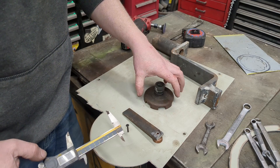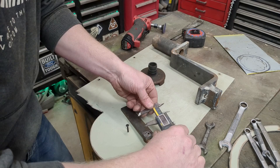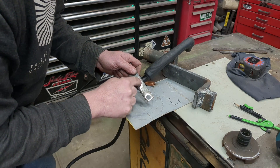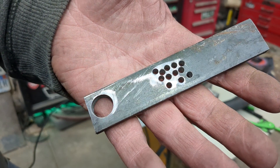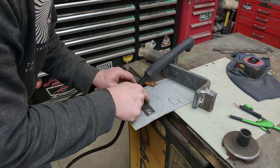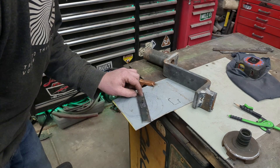I actually need to make a donut for this — a piece of sheet metal that sits up about half an inch around this. All I do is take my diameter here so we have our tip through here, halve it, and then mark where one hole is and drill a hole there, then mark where the outside is and drill it there. I drilled a bunch of random holes the same size as a sheet metal screw and staggered them so you can move it in and out a little bit. Then we just attach the sheet metal screw. This spins — make sure it's not going to get caught on anything. The inside is scrap and the outside is scrap, so I'll feed in for the inside like this and the outside like that. Because I'm cutting a donut I'm going to leave a little tab here and here, so I'll start, come around, stop, then start again.